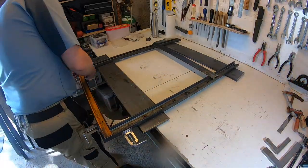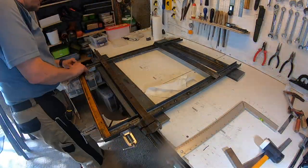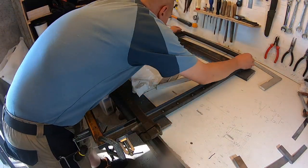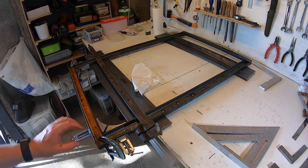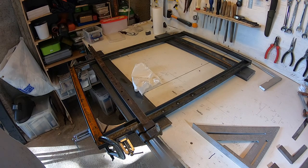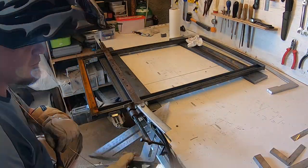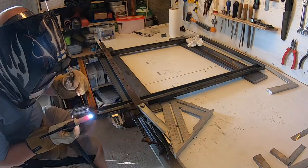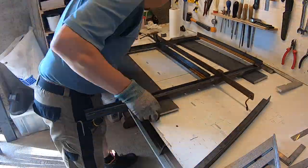Now I need to square up and clamp the frame. The U sections don't have actually parallel sides, so this is all a little bit difficult — where should I clamp, where should I grab, and I can't cover up where I need to weld. It's a bit of trial and error to get it right and secure, but I managed to do it eventually. I think I've got it pretty square. So I'm going to tack here and use a TIG welder — I just like it better.